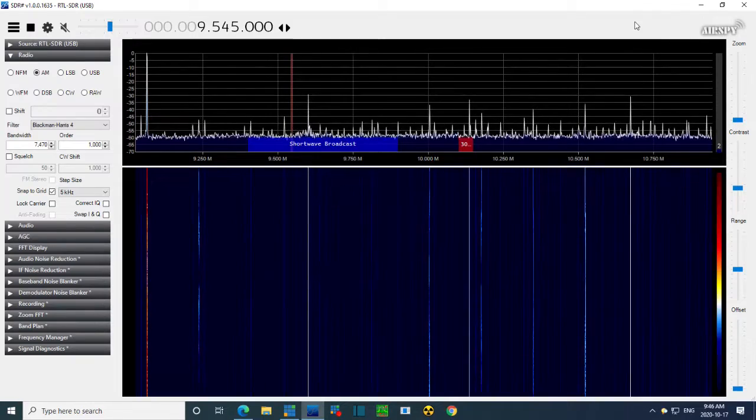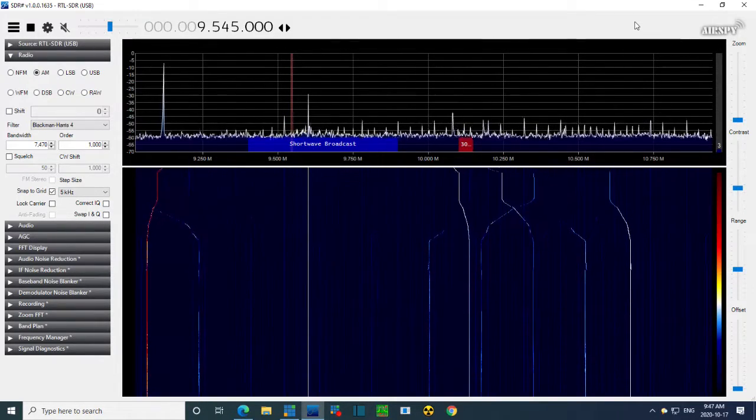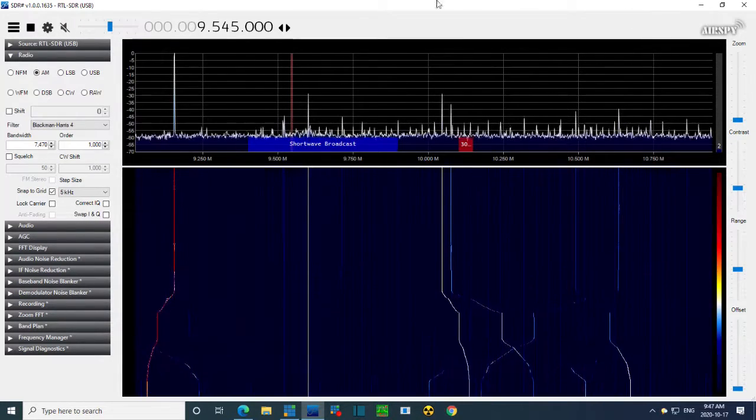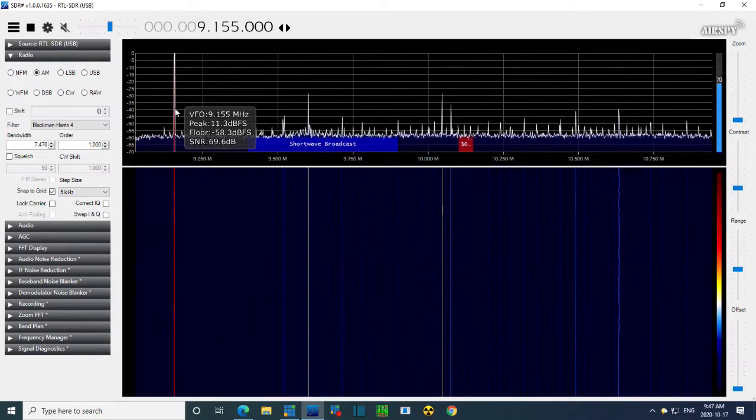Be very careful when using the SDR to do these things, because I'm going to tune the radio quite a bit here. If I didn't know any better, if I were just looking at this SDR screen, knowing what I'm doing with the radio, I would say the local oscillator is this thing over here. Can that possibly be the case? Oh, wow. So if this were the local oscillator, this radio is tuned to 8,7 something. 455 below that, that's 8700.